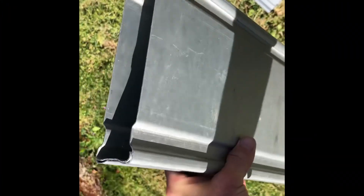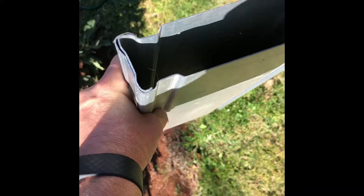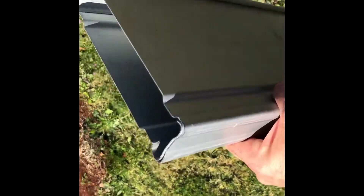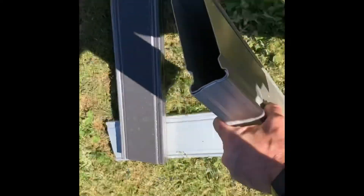Our firm lock steel beams are a double C-section — it's called a firm lock because it locks into itself. These are 1.2-millimetre thick gauge steel that comes already pre-locked together, so you have a complete box section beam on site.